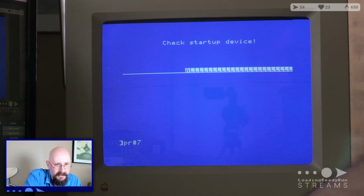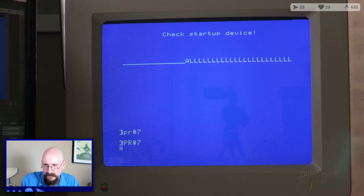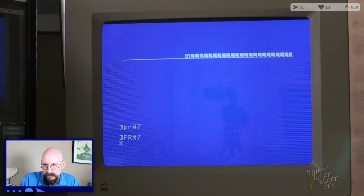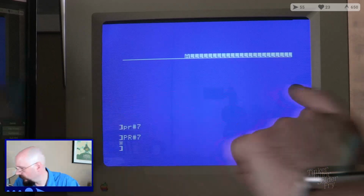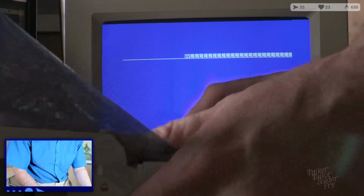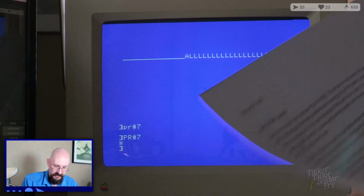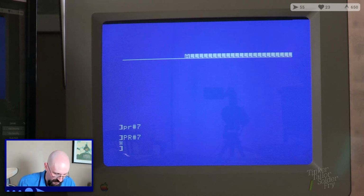Just going back here and reading you all here. PR number 7. There's a previous mention of CFFA dip switches. Yeah, I thought that I'd had the dip switches set correctly. I believe it's mentioned in the manual here, or not the manual, but the piece of paper, which says here's configuration dip switches in case you have no internet access. Switch 7 is the most important one, down for Apple IIGS and Apple III, and up for everything else. Start with all switches off, up.